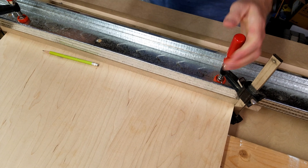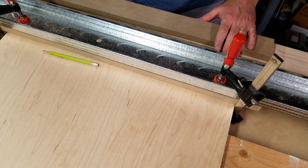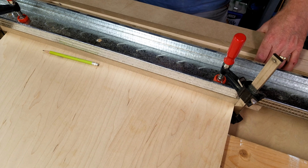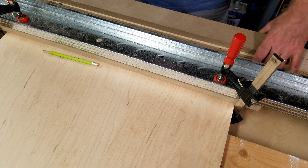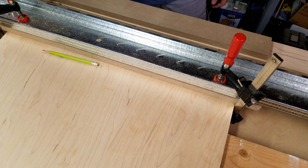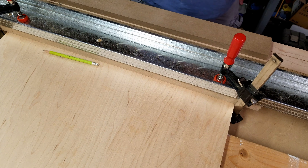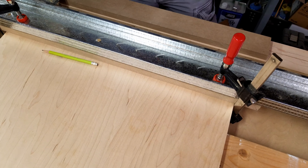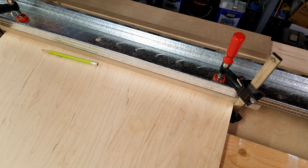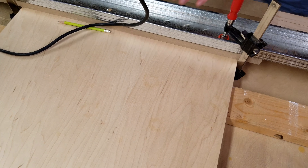This here is nothing more than a metal stud with a piece of MDF screwed underneath it. I ran a circular saw along here, which trimmed this piece off and acts as the saw's guide edge. Because I'm working over the edge here, I'm going to position it so it runs like this, and then I can just run my circular saw right along here — the shoe rides up against this straight edge and cuts it off. You want to start the saw before you hit the material; otherwise you'll damage your material and possibly kick back your saw. Let's cut this edge right off.